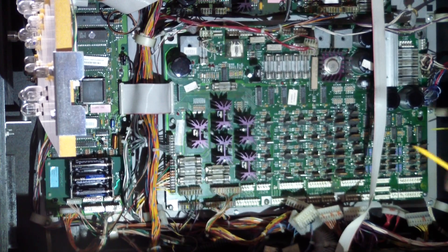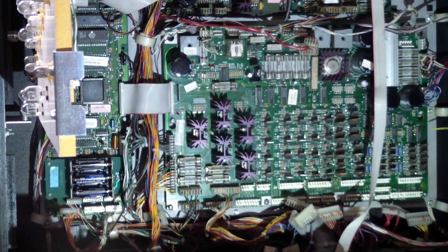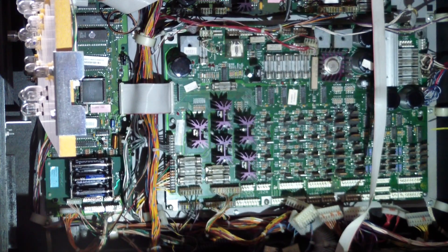The 12 volt regulator got replaced. We will also be testing this — it's called the 12 volt digital — and that drives the switch matrix, which is sitting on the CPU board. So it supplies 12 volts regulated to the CPU board. Because we're going to have to go into test mode to see if all the lights are working, the switches that let you manipulate the test mode are part of the switch matrix.